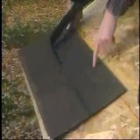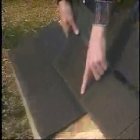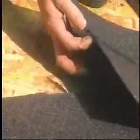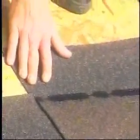One tab length offsets each row of shingles from the next and the last. If you feel along the top of a shingle, bending the top as you proceed with your thumb and index finger, you will come across a 1/2 inch deep cut. The distance from the end of the shingle to the cut is termed the tab distance.